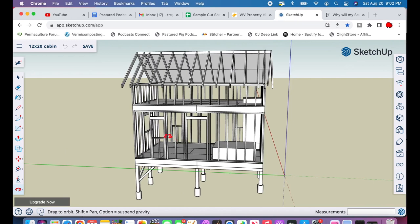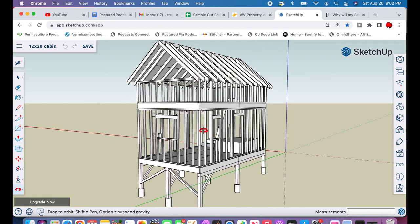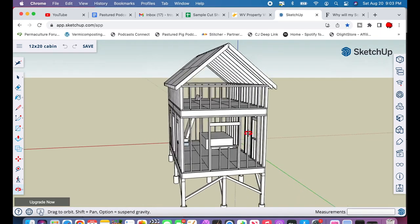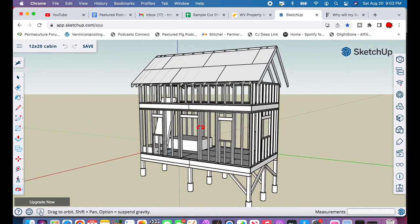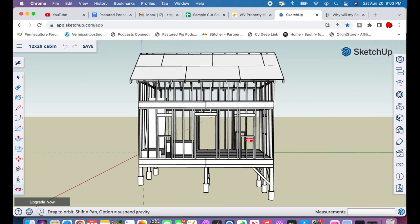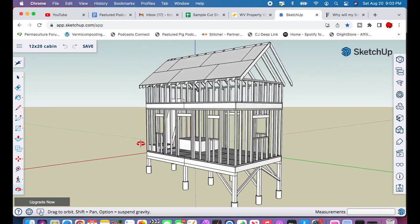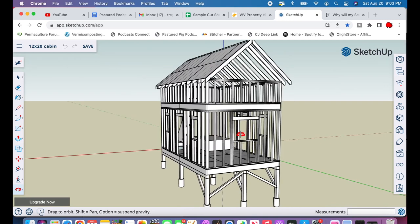The other half of the first floor will be a kitchen area and a little seating area — just a kitchenette, nothing crazy. Window sizes are just based on basic sizes right now; we're going to do some window shopping to find what we can, maybe find some closeouts, and that may affect the final size. We wanted a shotgun door setup — door in front, door in back — to help with airflow. The windows will line up, and we'll add a window on the other side for cross breeze.